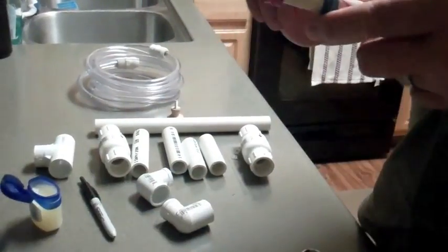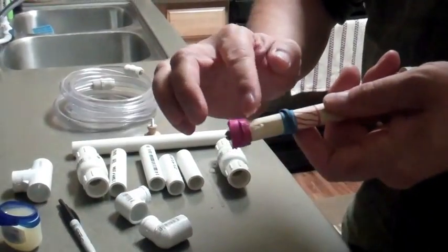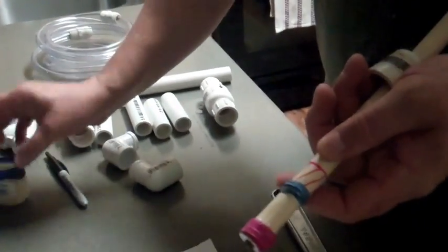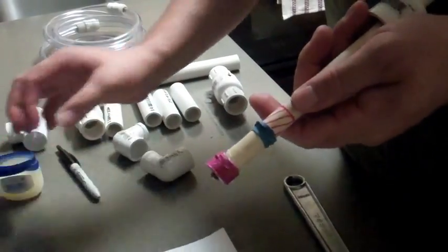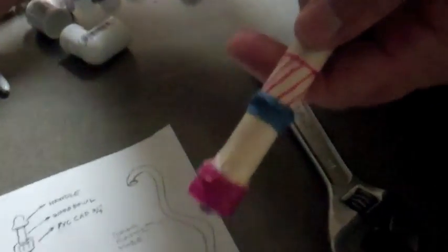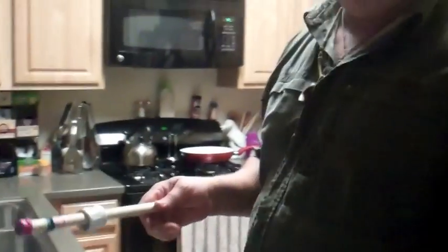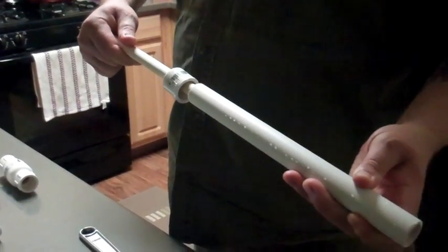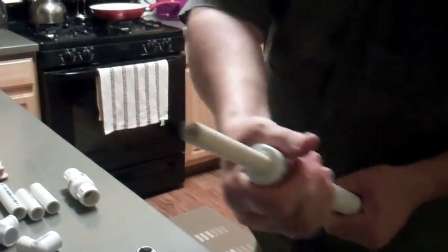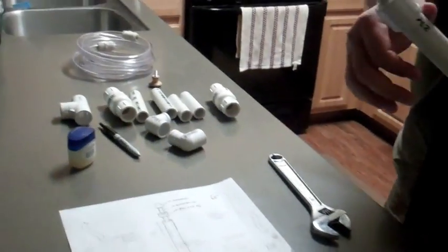This isn't going to bother you if you're pumping water. But I'd also put some Vaseline down at the bottom — not for lubrication, but so that later on if you don't have any Vaseline, you can scrape it out of the little groove and you've got extra Vaseline to lubricate the foam rubber with. Take your 12 inch PVC and insert your foam rubber side all the way down. Push your three-quarter inch cap on. I'm not gluing any of this and you don't need to — I want to be able to pull this apart and throw it into my bag and pack relatively easy.